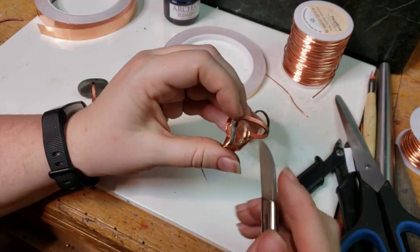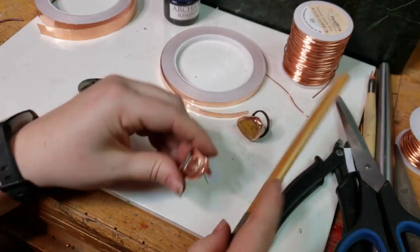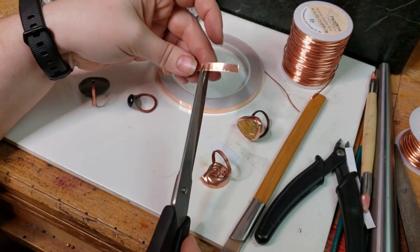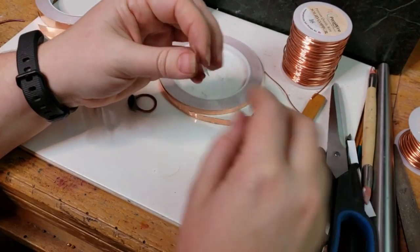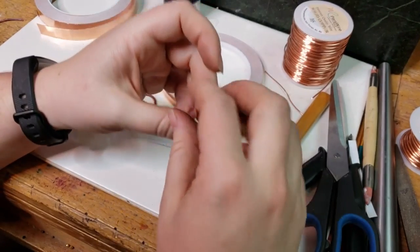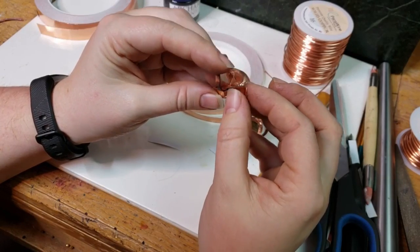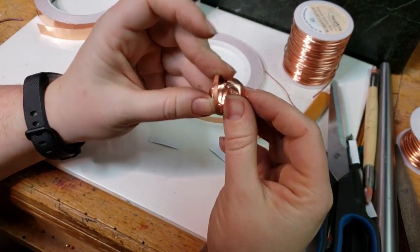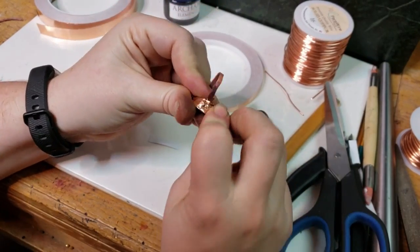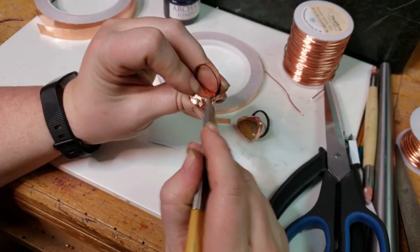And now from here, we could just paint with the graphite paint on these two open areas. And that actually gives us a pretty nice gauge for when we're electroforming. Whenever the black of the graphite is completely covered, it's easier to gauge the thickness of the electroformed copper than if we're just measuring copper on copper. Okay, so I'm just, again, wrapping the tape around. Burnishing.